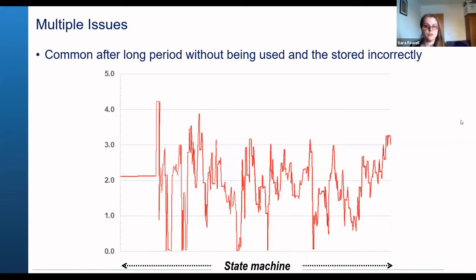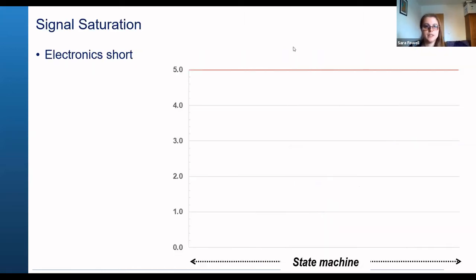If you've had a sensor stored for a long time on the shelf — if you've had problems with batteries, storms, or something and had to take the sensor out for a long time — the reagents inside may have started to dry. When you first plug it in, you might get a really horrible signal, but this looks worse than it is. It can usually be solved by flushing for quite a long period of time. It's probably full of air and maybe some bits of precipitated MCP — just cycle between flushing with water, detergent, and maybe some bleach. Sometimes you can get a full signal saturation, which can indicate an electronic short. If you see this a few times, please don't use the sensor — it means there's a problem with the electronics.